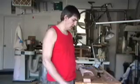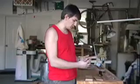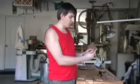Tools are sharp, so we can start cutting the dovetails. Okay. So first we have to decide where the pins go and where the tails go. Since I want the tips of the pins to be visible from the front, right? That's the most visually appealing thing. I want to have them on the front piece, right? This is going to be my front piece, and which means I will have pins coming from the left and right sides and going through the front piece.